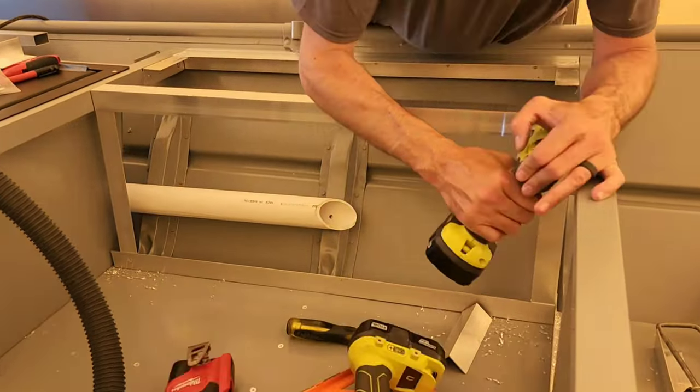I began work on cutting and mocking up the trolling motor mount. As if the recessed foot pedal tray inside of a lid wasn't enough, I started working on mounting a seat base inside of the next hatch lid. This was planned in advance as the lid was reinforced with 1/4-inch aluminum plate on the underside of the lid. I also temporarily mounted the rear seat base as well. Everything that the turf decking would go around needed to be in place for the scan. Just like that, everything was mocked up as it would be in the final product.